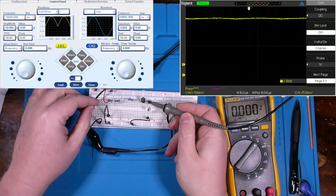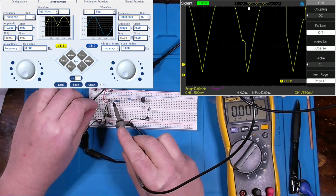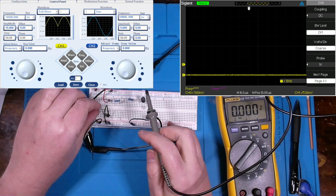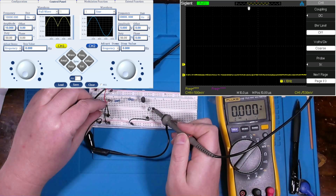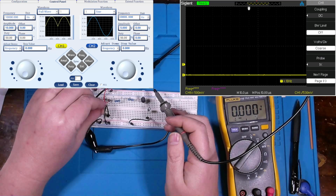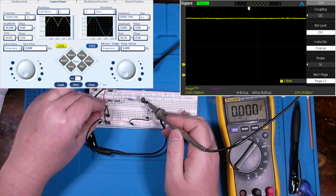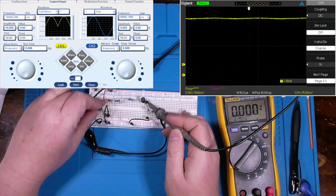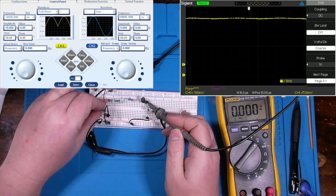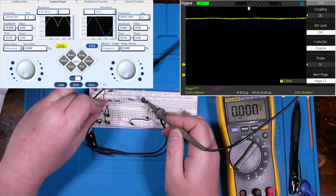Yeah, super little amount. And I'm just going to put this back in the beginning again. So we know a capacitor here definitely eliminates ripple in the entire circuit. And then our inductor, and basically our LC circuit here, is essentially removing the remainder of that ripple. But you can see when I put in the capacitor at the beginning, it removes some of that. So this is capacitor in, capacitor out. You see how that DC signal gets a little bit dirtier when I remove it?